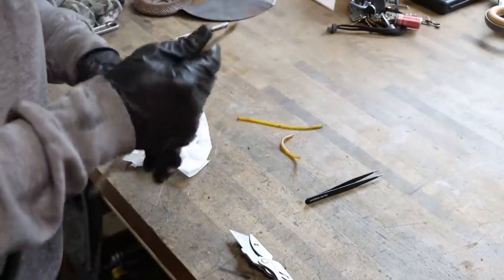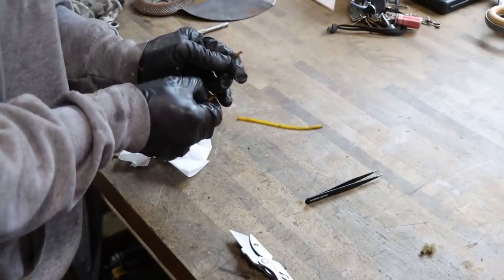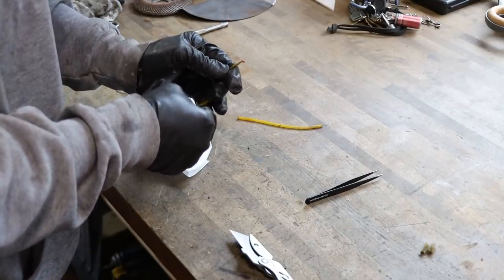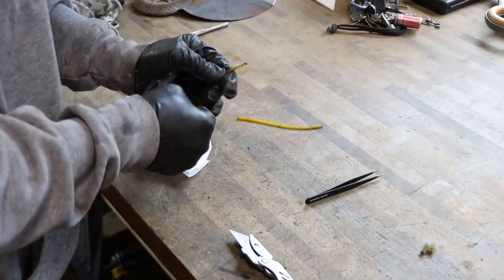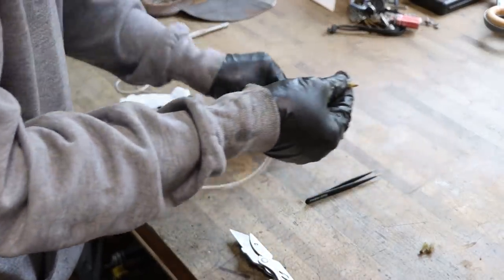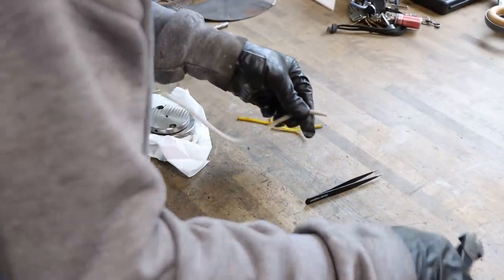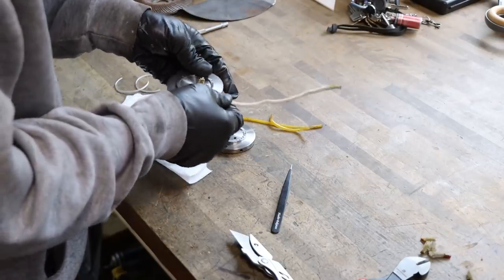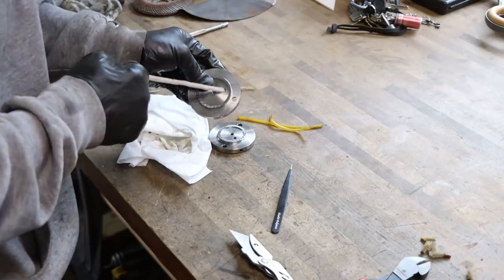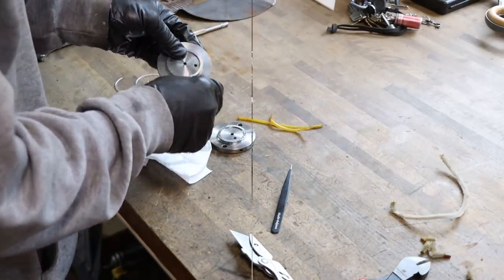What little bit of grease that's in the bearings that are left on the head of the milling machine, that'll get diluted as you put fresh oil and stuff in it, it'll work its way out. But putting grease where it's not designed to go causes a lot of work. And it's a shame, but that's the way it goes. And I would have to tear this machine down no matter what, having to rebuild it or not, simply because it's had grease put in it.